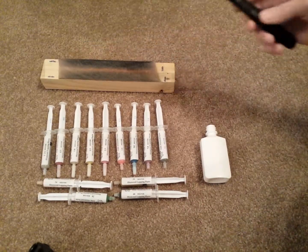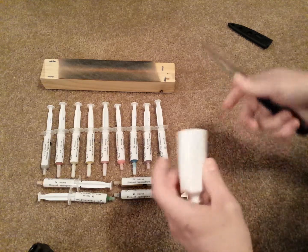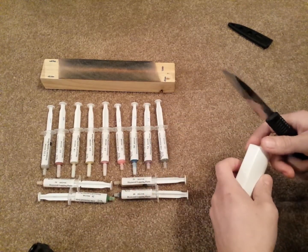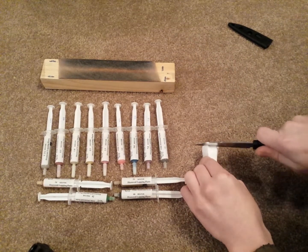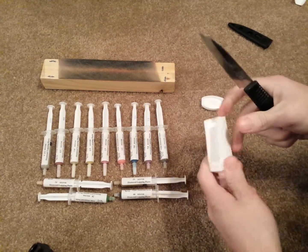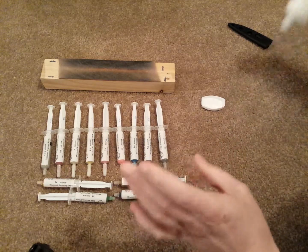Here I have just a cheap knife that I've reground and stropped on the strop. When cutting plastic with a highly polished edge, the problem you often run into is that the edge will not bite into the plastic — it'll want to skip off, which can lead to injury. But with this strop, you can just bite in and make a clean cut through it, no problem. And it's not what I consider super thin plastic, but it is a challenge to cut if your knife is not reasonably sharp.